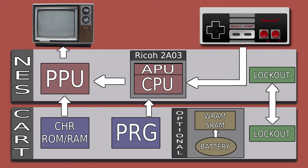Another component you see to the left is the PPU, which the CPU talks to through memory mapping — that's going to be the topic of the next video. The PPU of course handles all the graphics which will be displayed by the TV, that's why you have the arrow pointing to the TV. The controller also talks to the CPU and has its own memory mapping location. The last component for an NES is the lockout chip, which both the cartridge and the NES have.